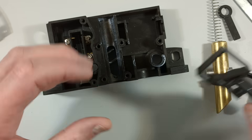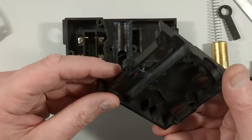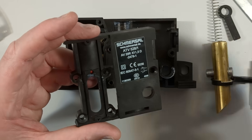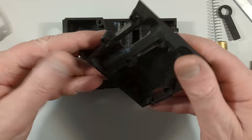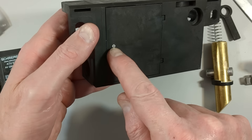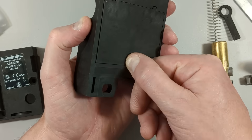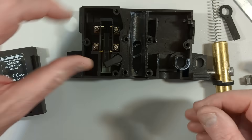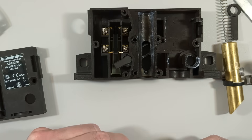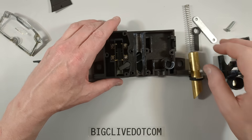But there we have it — the Schmersal mechanism. What's that little red dot for? Sometimes I wonder if these are telltale indicators to show if you've opened it, or maybe it's a bearing. There's another small pin here — another of the latching pins that are just pressed in rather than screwed, to avoid people tampering with and bypassing it. It certainly took a long time to work out how to put this back together again. That's the inside of a Schmersal elevator safety interlock from our old lift.